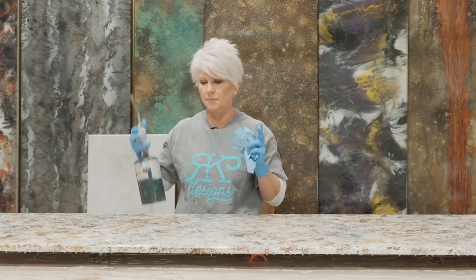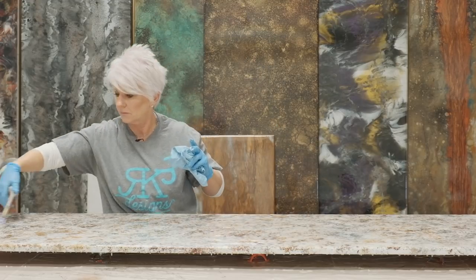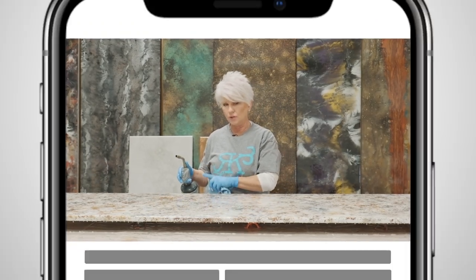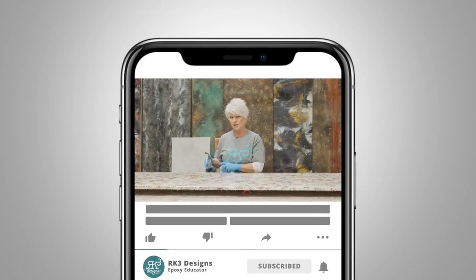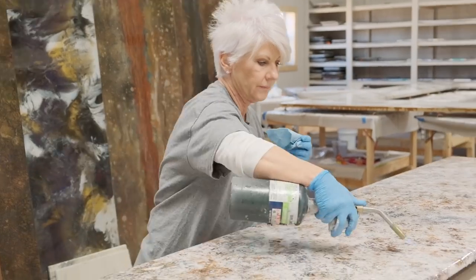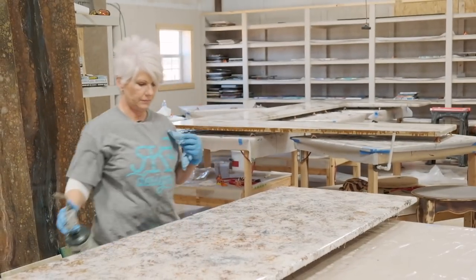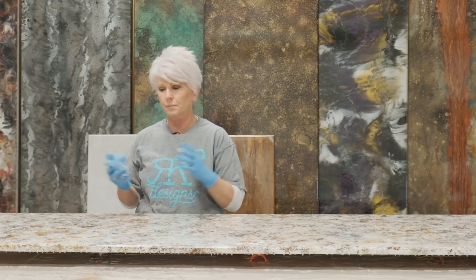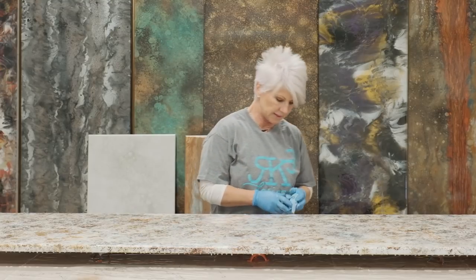So I've troweled and chopped. Now I'm going to take out my bubbles. When I'm torching, I don't torch my edges a lot — I don't like to put a lot of heat on my edges because it causes it to run thin. But if I see some big bubbles, I'll hit it and then pick up a little bit more of the drips, readdress my edge. Now I've got a nice beautiful level finish and bubbles are popped.